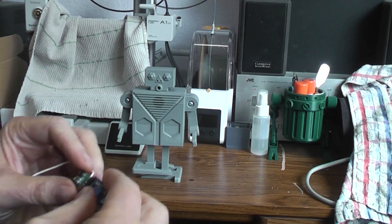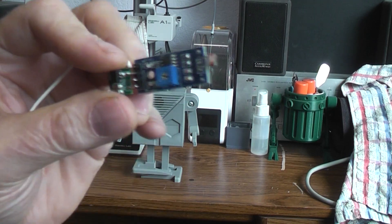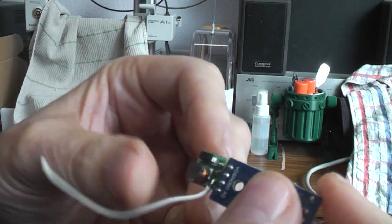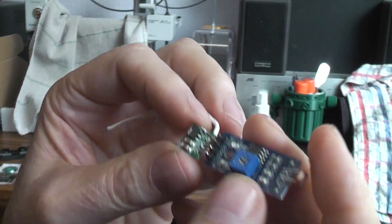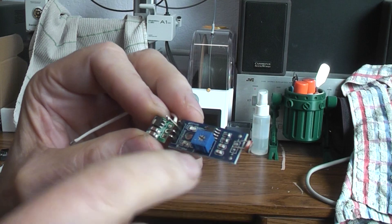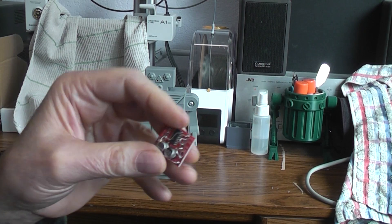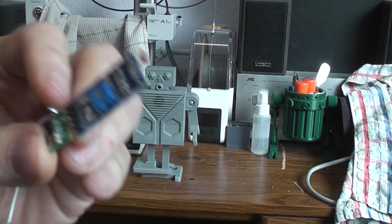To sense when you've hit the target, here's a photo sensor — this little light sensor board which you can find really inexpensively. It's got an adjustment pot for the sensitivity. This little green board hanging off the back is a voltage boost regulator, and it's going to take anything from below two volts roughly and move it up to five volts. I wanted the voltage to be stable since there's a comparator on this board, so I'm running this board on five volts and also running the sound board on five volts. The H-bridge for running the motor is just running off the three volts right off the two double-A batteries.